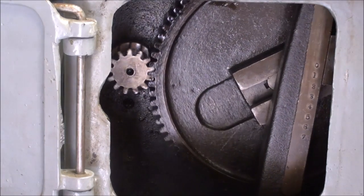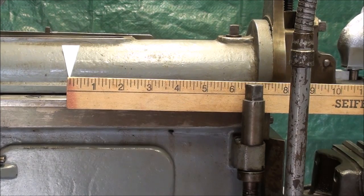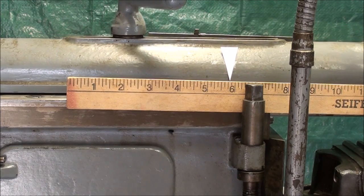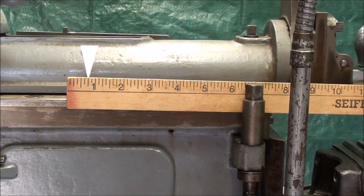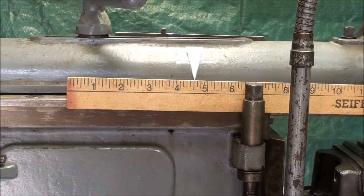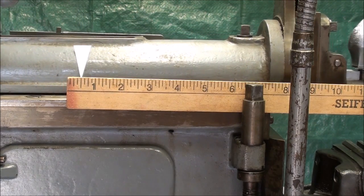Make sure you keep that cover closed in normal use. I've got the shaper set for a rather long stroke, about six and a half inches — seven inches is the maximum. The reason I did that is so I can get relatively large numbers to measure both the return and the cutting stroke, so I can compare the two. That's what I'm looking for here: a ratio with whole seconds, rather than messing around with hundredths of a second like I did on the other teaching aids.